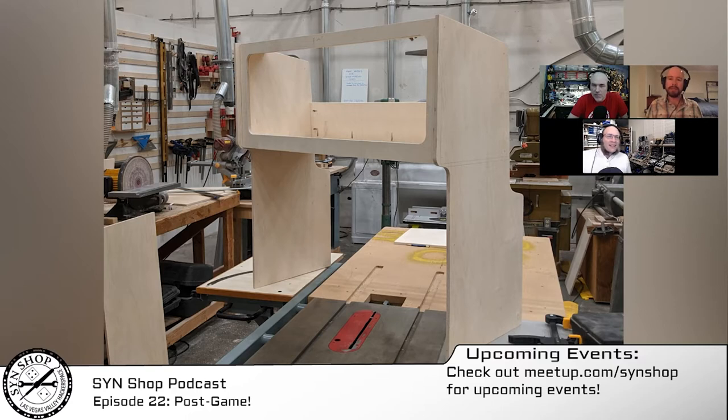It's sort of a hybrid: done by hand, done by template. I do a cardboard template, transfer it to three-sixteenths melamine, refine it — melamine is pretty forgiving to sand — and once I have my real template I take it to Baltic birch, screw the template into the birch, rough-cut on the bandsaw, then take it to a flush-cutting bit on the router. As long as your template doesn't move, you get a pretty repeatable pattern.